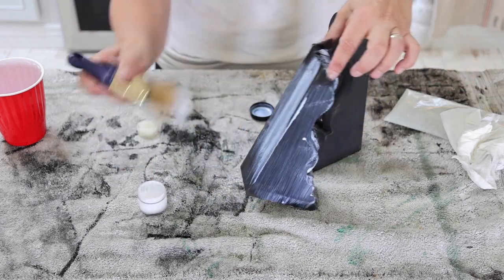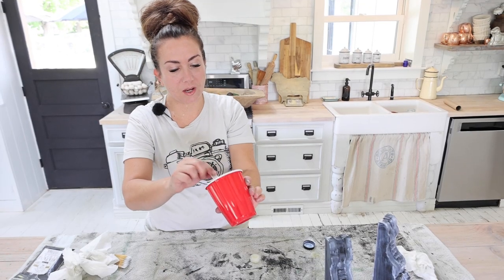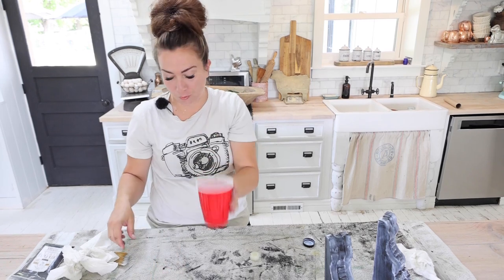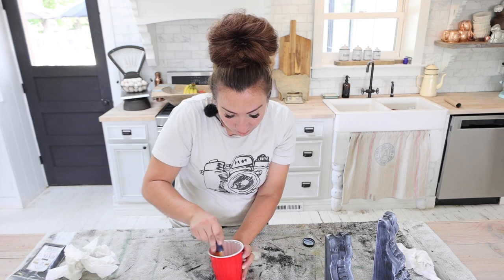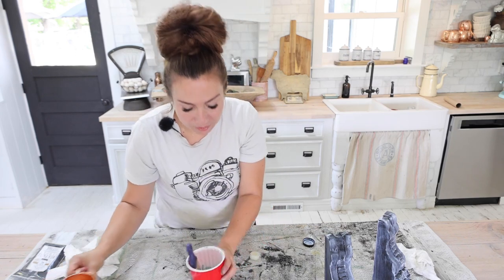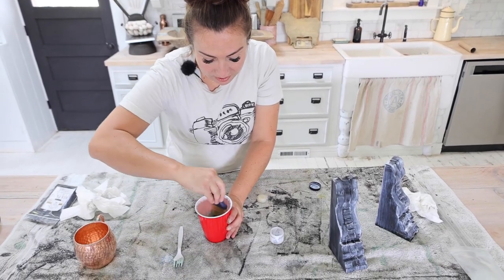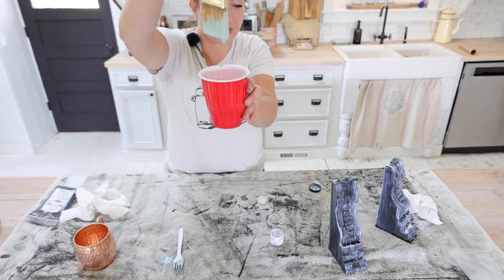I'm not going to do the bottom because nobody's going to see that since these sit up. We've mixed up our milk paint the same way we did the black. You either have Sweetie Jane or white, and I'm just going to use my brush to go around the edge and make sure I've got it all mixed. I can feel it's a little bit thick so I'm going to add just the teeniest bit of water. If you get it too thin you'll have a situation on your hands — melted milkshake consistency is about perfect.